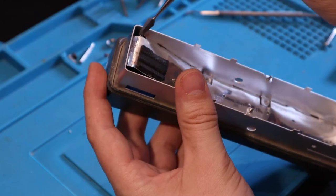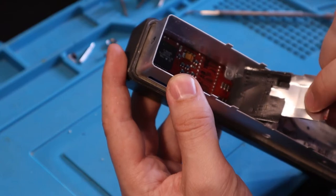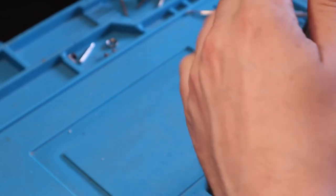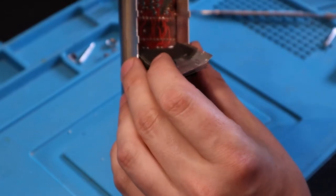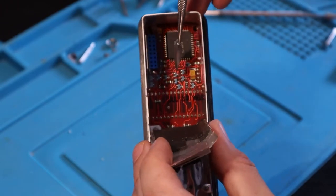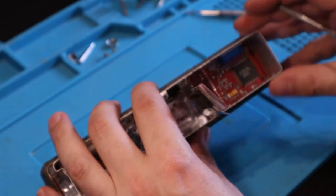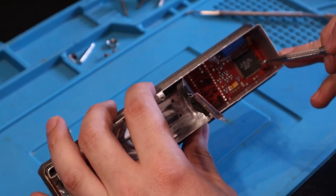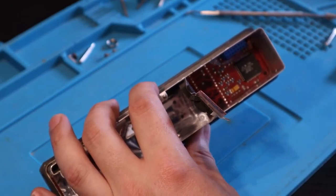What's underneath this? A lot of shielding as well. There are goodies down there. We've got a 1986-dated chip - it says on here July the 23rd, 1988. So this phone was made in 1988. There's a chip here: SC93408 CFN, 60C04, made in 1986. There's a lot of shielding in this - they were mad keen on shielding back then. They were frightened that anything electronic that could radiate would mess everything up.